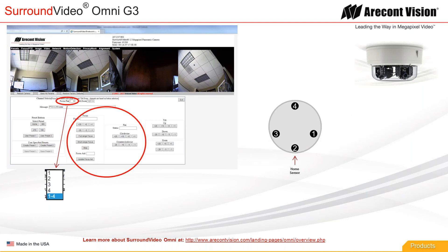If you've mounted your camera and didn't pay attention to the front arrow, and you've gone to your 270 or 180 preset and you're not looking in the right direction, we have options to adjust that. You can go to the individual focus PTZ tab and individually move each gimbal to fix any issues. We also have an option — a drop-down menu in the focus and pan tab. One of the options is 'one through four.' If you want to move one of the gimbals, you can select one, two, three, or four and pan those individually to tweak them.